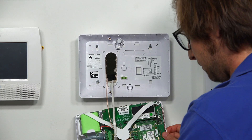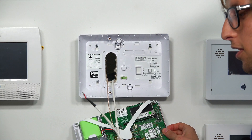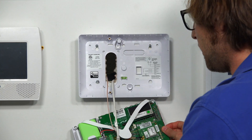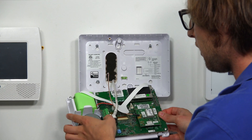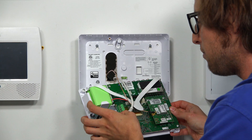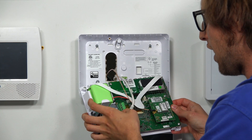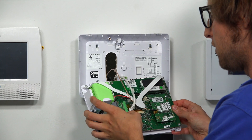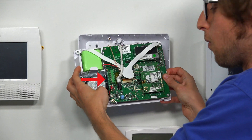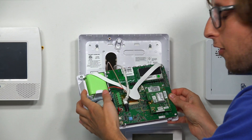The other way to do it — I'm going to show you the other end of the LT cable that we didn't use. You can see it has the red for positive and the black for negative. What you would do is connect to the terminal block right here next to the speaker. It's got the V plus for positive and the V minus for negative. So you would connect the black one to V minus and the red one to V positive, then connect the rest of your LT cable or whatever cable you're using.